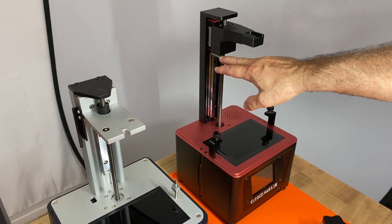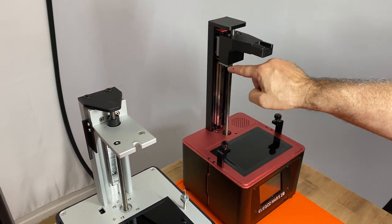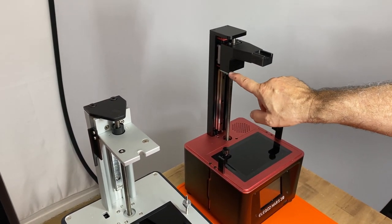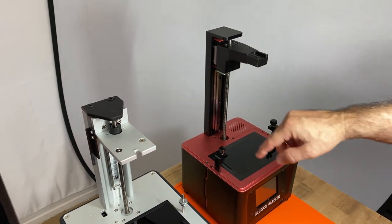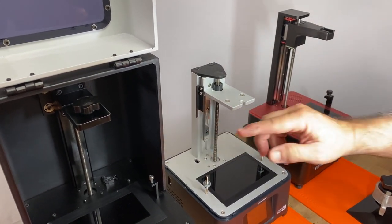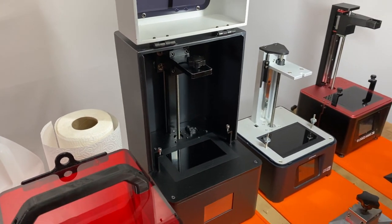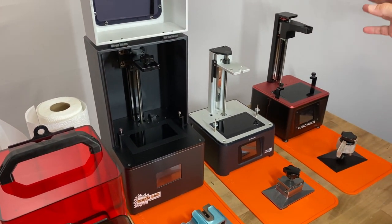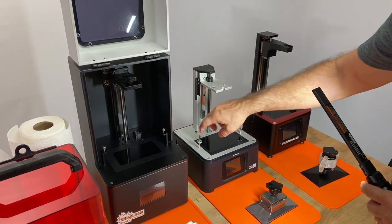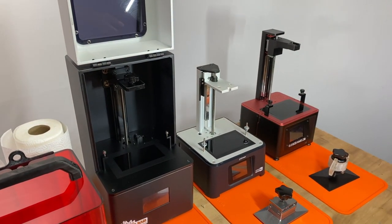When the arm is mounted to the bottom of the build head, you only need to put a spacer between the original plate and the build head — that's 2.6 millimeters. You can make this yourself using washers or nuts, or get one from our website and print it out. For some other machines there are already models of lever arms created with 2.6 millimeters of extra distance. For machines with a non-removable metal arm, all you have to do is put a little cuff over the end that extends it down the extra 2.6 millimeters.